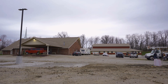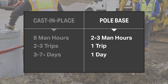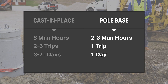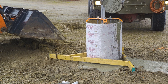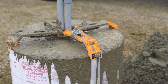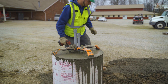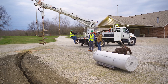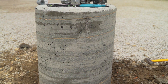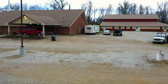The precast option for this project took just two to three man-hours, where the cast-in-place option was about eight man-hours. With precast, we can do everything in one day — but you can't quantify a mistake that didn't happen. Bad bolt patterns, the bolt pattern oriented the wrong way — with precast, you don't have those mistakes. You don't have to go back, you don't have to redo them, you don't have to coat the base, because it's all done one time.